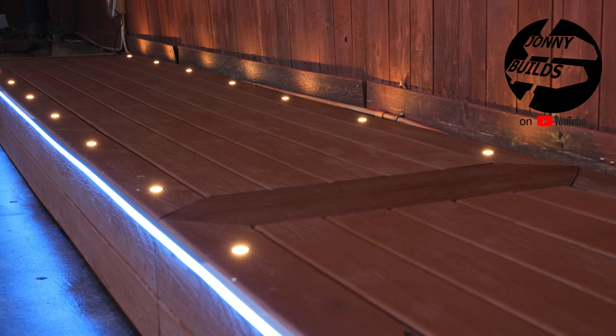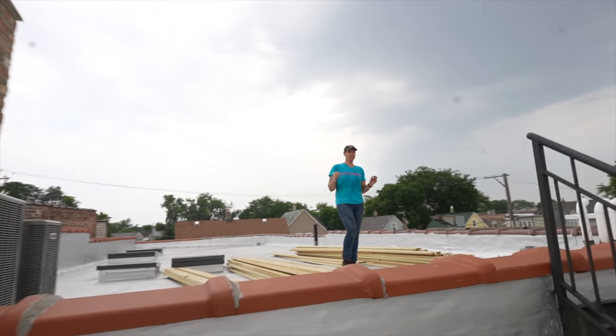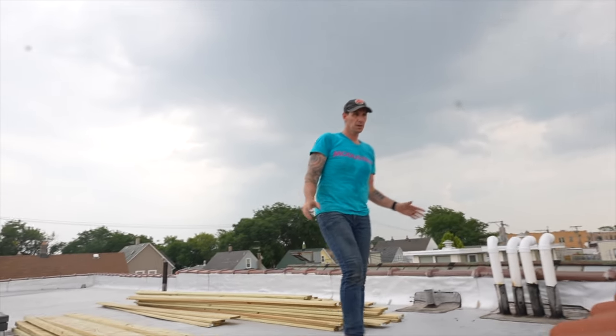By the way, guys, Johnny just built a deck on his channel, so he's got a lot more experience than I do, so I'm kind of just deferring to him on a lot of this right now, so you should listen to him. We'll cut the sleepers to 8 foot, and that'll give us the entire width of the deck itself, and then we need to cut the joists 3 inches shorter because we have to account for the 1.5 inch material on either side.